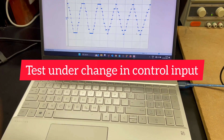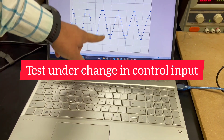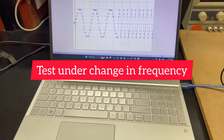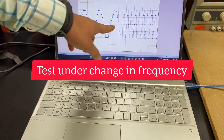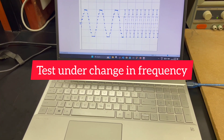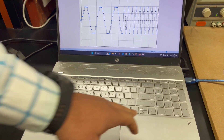Similarly, other results are taken with dynamic test conditions — such as a change of modulation index. As you can see, when there is a change in modulation index, there is a change in the voltage pattern. Results are also taken with frequency change conditions. You can see that when there is a sudden increase in frequency from 50 Hz to a higher frequency, this inverter is still working fine without any interruption, maintaining the 9-level output. This demonstrates that the capacitors are self-balancing the voltage.